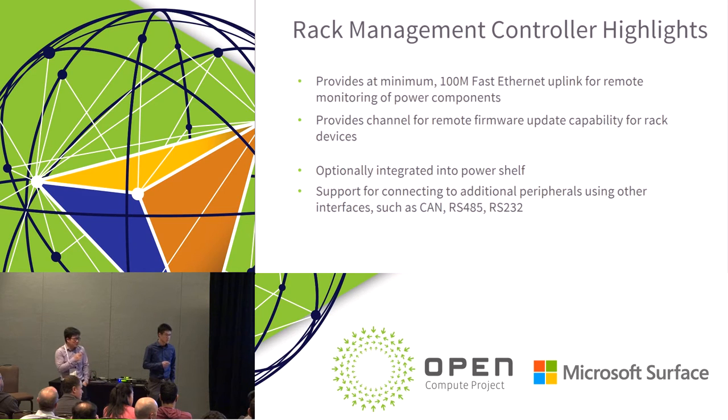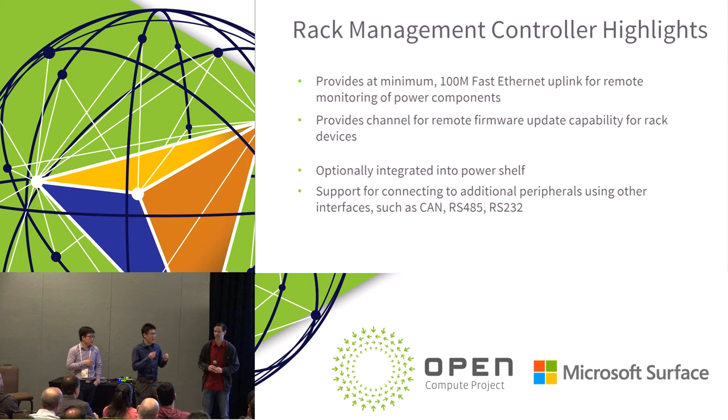Thank you. As part of the design features, the connector may look like just one set of pins going across, but that's typically something that you don't see within a bus bar connection. Bus bar connections usually have all the pins at the same distance on both sides, but we have a stagger on the bus bar side, and even within the connector, as Shin mentioned, there is one pin that's offset going off of the power side as well.